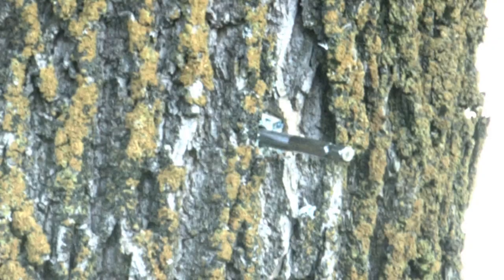So failing that, I moved on to try to use a spade bit like this. These usually work really well. They go through the wood, they don't stall. Well, I drilled in, it started to go through, and then it just got stuck. And when I say stuck, I mean really stuck. I tried everything, I couldn't get it out. It was actually the half inch version of this bit that I used. So it looks like it would have worked, but I would have had to back out a lot. I just didn't realize it would get stuck that much.